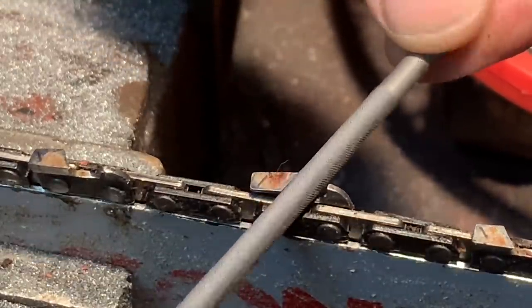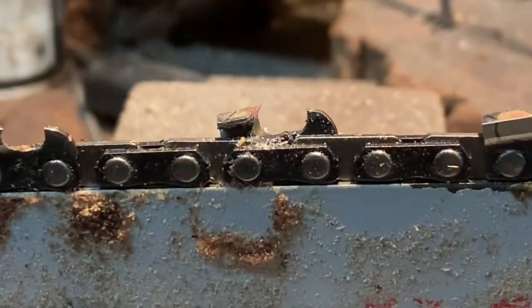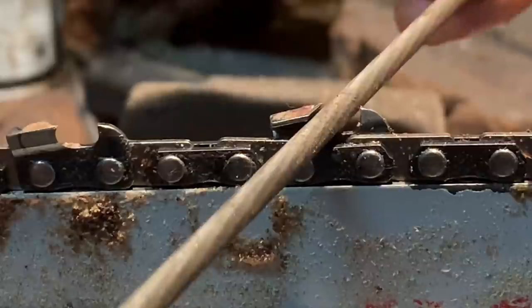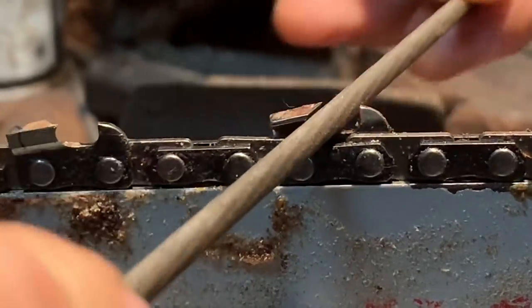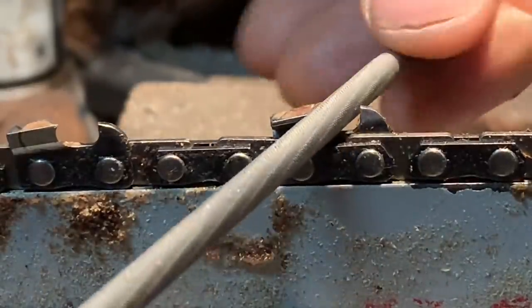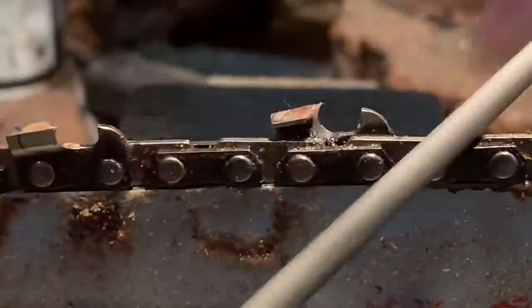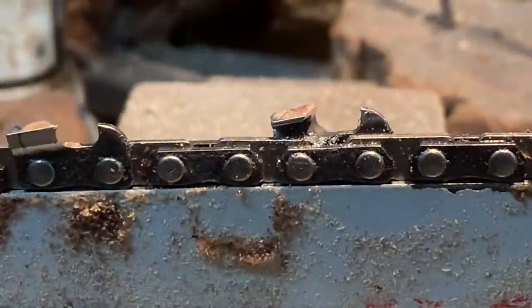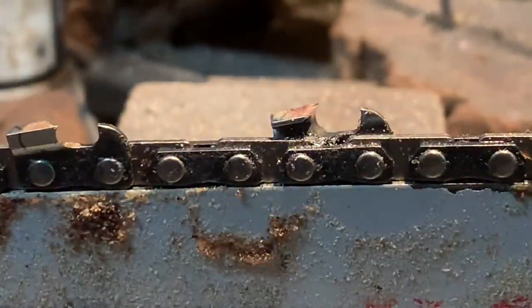You see what I'm saying? So let's look at something else. There's the tooth we just filed. You're actually right underneath. Here's this little guy — look what actually happens. You can see the space. So I don't use the 5/32". You can in a pinch, but it means you have to stay up on here like this. That's the 5/32". Here's the 3/16". These call for 5/32", they do, friends, but I don't do it. Look — it's beautiful. It rips the gullet right out, gets underneath the top plate. This is full chisel chain.